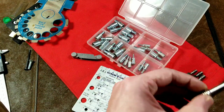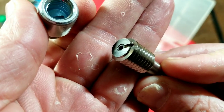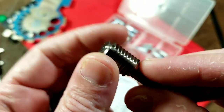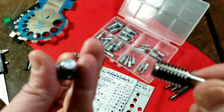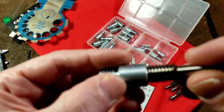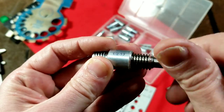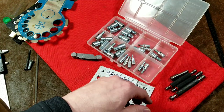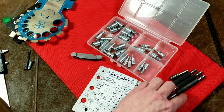I also have a half inch 13 go gauge. A really nice one will have a little cutout to knock any burrs or particles out of the threads — that's the difference; some don't have that cleaner cutout. This is a go gauge so it's supposed to thread in nicely and not have too much play, so we know that even this half inch 13 is pretty good. These gauges can actually be picked up fairly cheap — I found this little four-piece set in a glass case at a pawn shop and decided to pick them up.